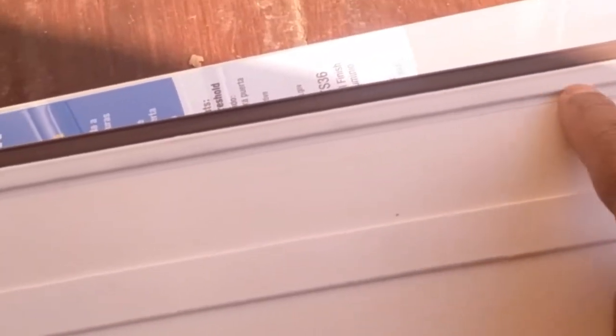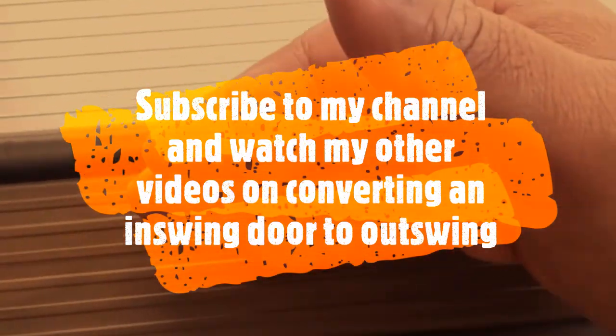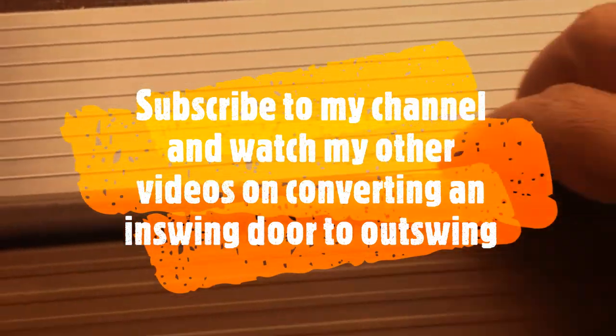The other advantage of the expensive one is the material. The top material of the cheap one is fine, but the bottom has wood in it — covering the portion that needs strength — whereas the expensive one has composite, so it's not going to rot. I'm putting it in a lower level where water hits a lot, so this is the better solution. To summarize: for an out-swing door, you want the door to close over the threshold, not sit on it, and you want a good seal — which can be replaced.